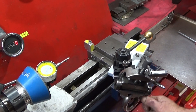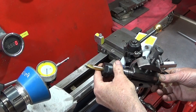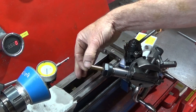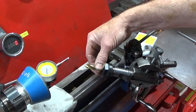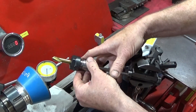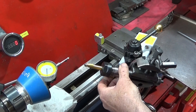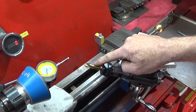Wind the carriage back and put in the spindle with the ER collet chuck on it. The spot drill is already locked into that ER collet chuck and you don't need to take it out after the grinding. When you're actually doing the grinding you can wind back the carriage and take out the spindle to examine it and do a re-grind if necessary. You only take the tool out at the end of the grinding when the tool is finished.